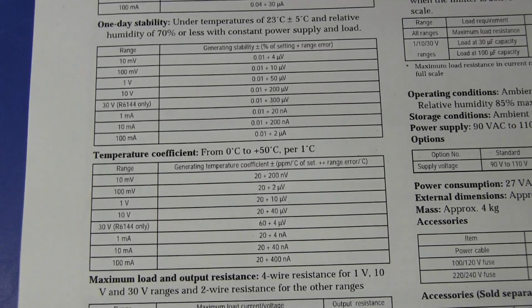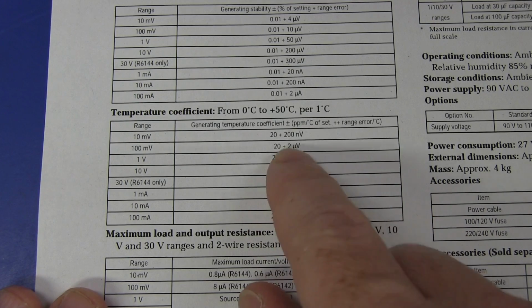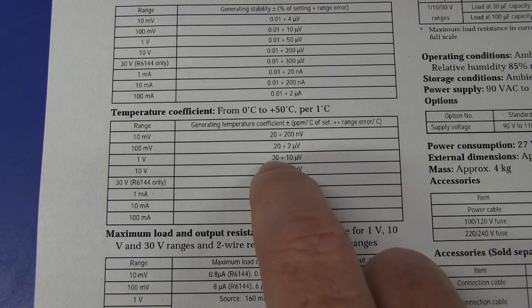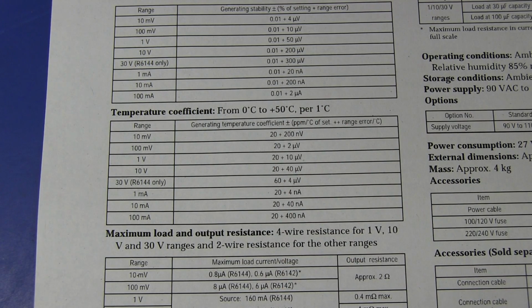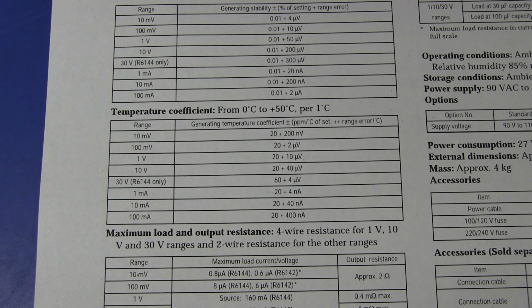So these specs are essentially, because it's likely over-engineered, good enough for calibrating a 0.05% microcurrent. And the temperature coefficient here, i.e. the parts per million per degree C, is in the order of 20 odd ppm per degree C. Not bad, although my HP34461A that I'm using has a nominal 5 ppm per degree C. So it's at least 4 times better than that.